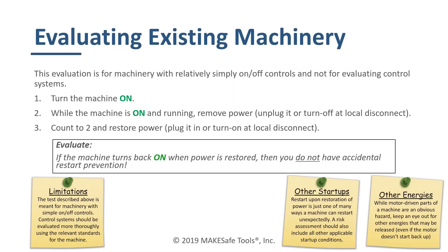That logic is backwards. An amputation caused by a $90 saw is the same as an amputation caused by a $10 million CNC machine. So really think about all machinery. Also, don't assume a new machine complies — it is not the manufacturer's responsibility to meet OSHA regulations. That is the employer's job legally. When you buy a piece of equipment, it may or may not have these features depending on the manufacturer. For standard woodworking or metalworking equipment, there's roughly an imaginary line between $1,000 and $2,000 — above that they tend to include magnetic switches, below that they tend not to.